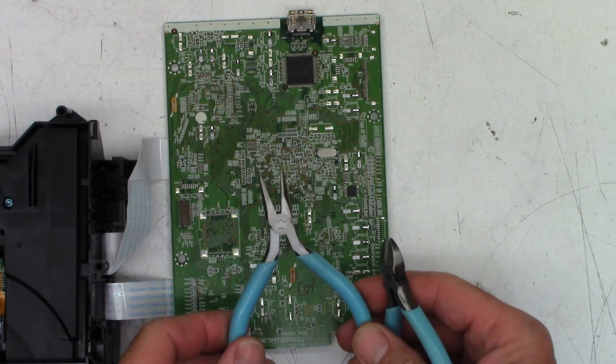Okay, all the capacitors have been replaced. So we'll put it back into auto magical focus. That way I can actually stand it up and you guys can take a look at the soldering. I'm very happy with that. I don't see any issues. Look for solder bridges very carefully